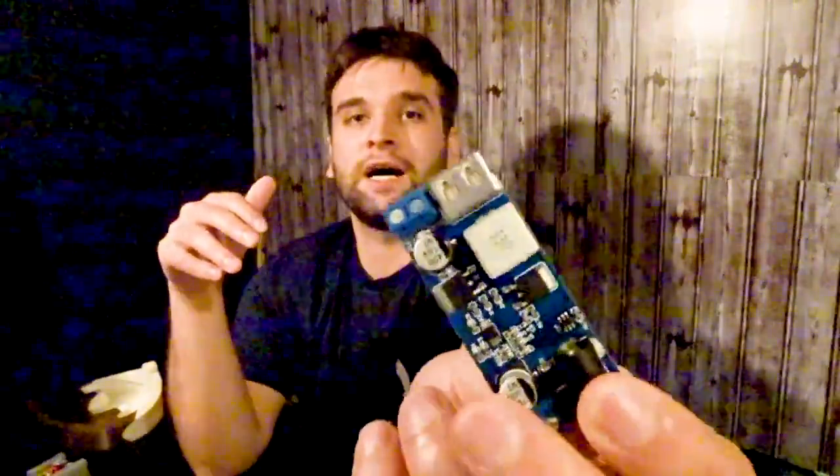But it's not all great about the XY3606. One thing I really wish this board had was some screw holes, because in order to implement this into Wolfie I had to come up with some creative solutions. Without mounting holes, it's basically impossible to put this thing into your robot unless you make some kind of contraption to hold it in place. There's also no real labeling on these terminals indicating which one is positive and which is negative.